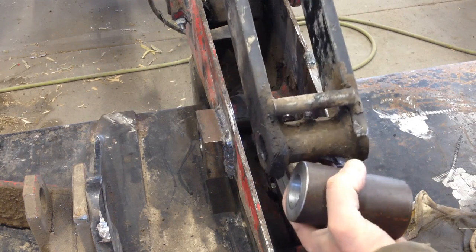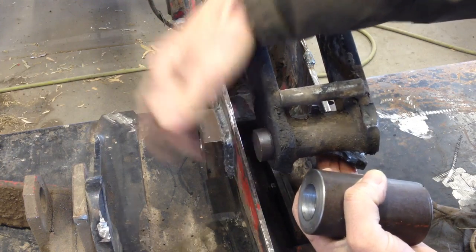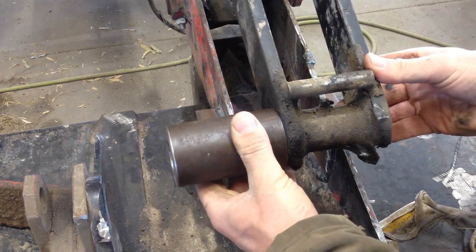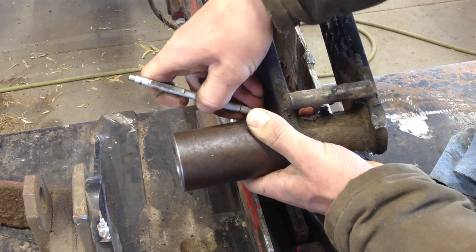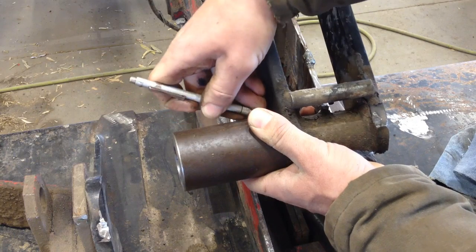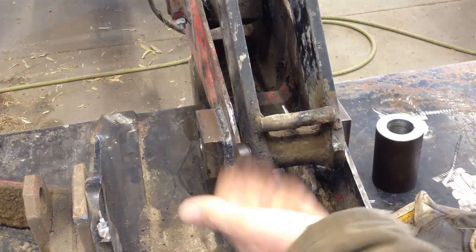I've been trying to figure out how to get this in line. I stuck a one-inch shaft on here back in here and just tried to align it, but there's too much slop — I don't feel comfortable with any of that. Then I remembered that over on my press I have this little one-inch to inch-and-a-quarter adapter that I use a lot over there. One inch fits in there, inch and a quarter fits in there — a little bit of play just because of slop in the machine, but I think that'll work great. I'm going to trace around it best I can with the scribe — and I have a mark. So I think I'll just take the plasma cutter to it now.